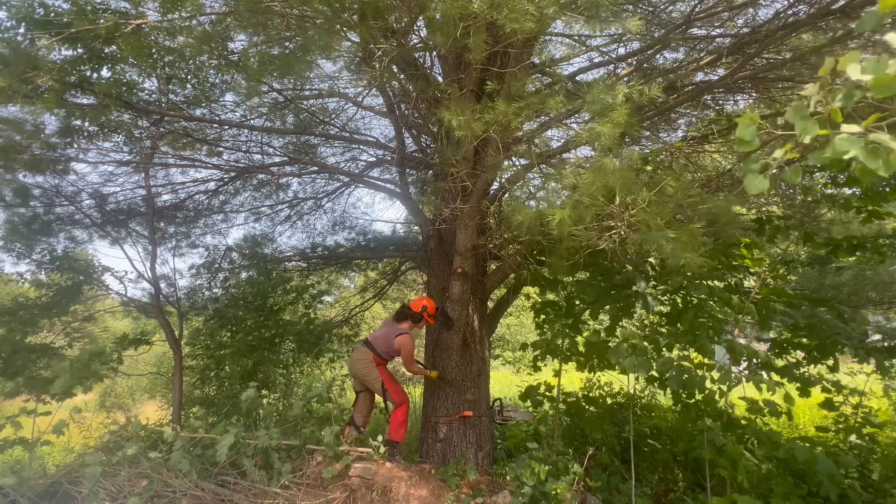My chain is pinched. I didn't expect it to back lean at all. I tried to get the wedges in and it's just so pinched now. It's not a good situation to be in. The wind came by and that saved so much work. I'm actually quite happy with the cut. I think I would have maybe gone deeper into the tree, but you can see the hinge wood that was left — it was holding the tree in place. If I had cut through it, the tree would have gone anywhere because it clearly had a back lean, which is why my chainsaw got pinched. Luckily that wind took it.